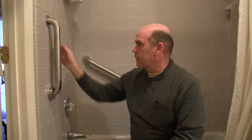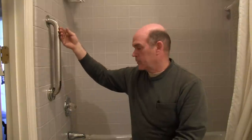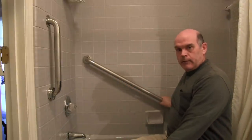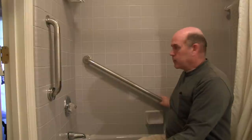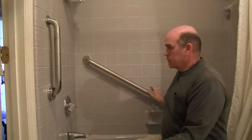On this application, I'm putting four screws in each end spaced out as widely as I can. You want to have the grab bars set at a height so that a short person can use them and a tall person can use them. This one in the back I put in on a slant, so when you're sitting in the tub you can grab a hold of it and help yourself stand up. Or if you're standing up in the shower, you can hold it at this end, and once you get up you can hold here and hold here to get out.